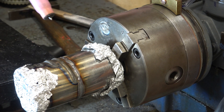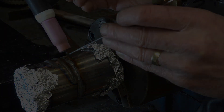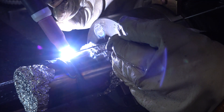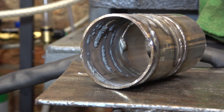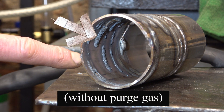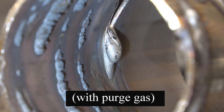I couldn't see what I was doing with the torch on the stand, so I'm going to go back to basics and just try it handheld. I think I'll leave it there for this one — obviously I need a lot more practice. Don't go — you might miss this. Even though my welding is rubbish, the purging worked. If you look in there where I've done these various runs, you can see how they're oxidised. But that big melt-through is not oxidised. So the purging worked.